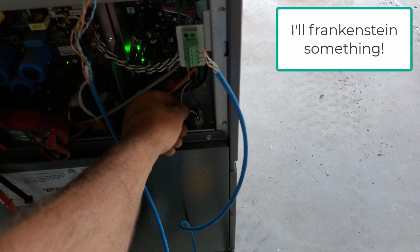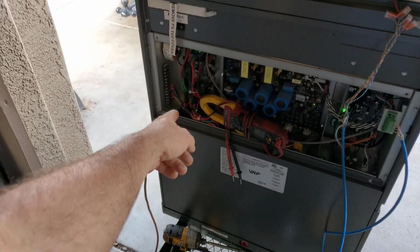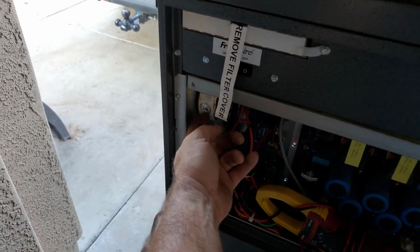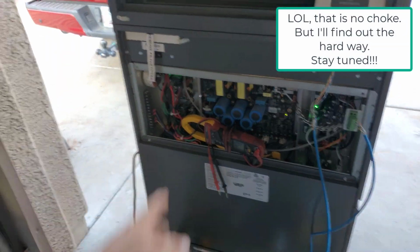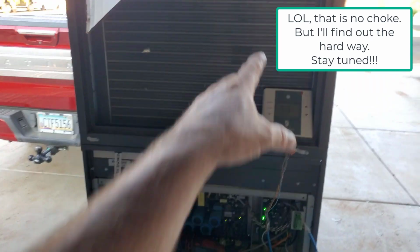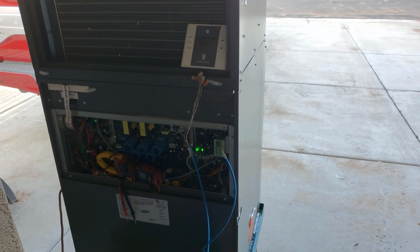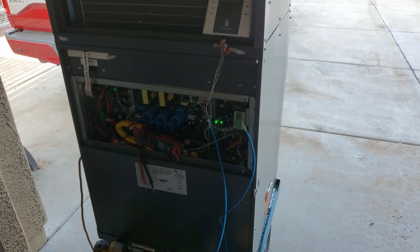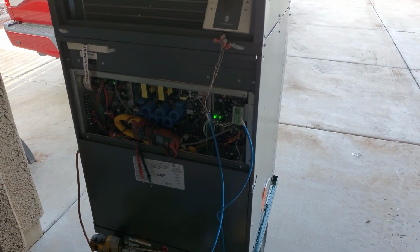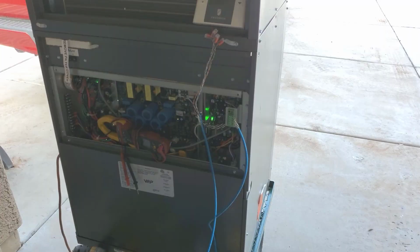There's four wires. I'll just see what they are. And then the high voltage DC bus goes to this choke. Actually, that's AC voltage, sorry. Going through that choke and then into the blower motor, it converts to DC in there. On the high walls, it's already DC. The circuit board sends high voltage DC to the blower and to the condenser motors too.